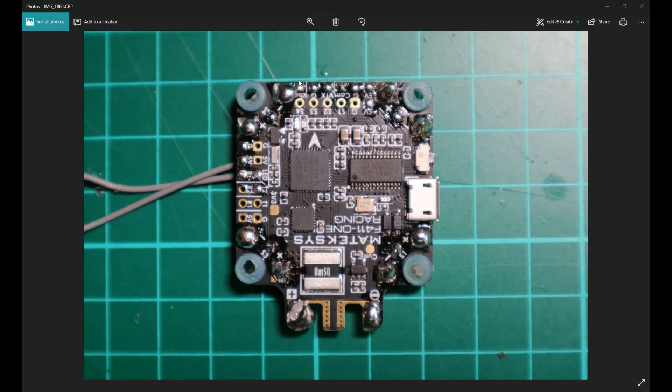VBAT was soldered by accident - and look how bad this solder joint is, this was me just taking the board out quickly. You need to do VTX and ground, and grab one of the 5V pads from over here, because your Unify Pro or video transmitter will need 5V input, the video signal, and ground. That output goes to your video transmitter for OSD. Then your camera comes in, the ground from the camera connects here, and the 5V comes in here - I believe it has a common ground. That's pretty much it for soldering this up.